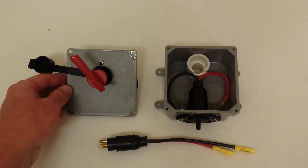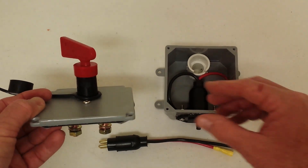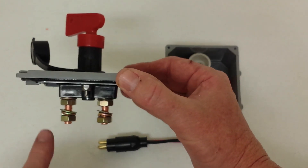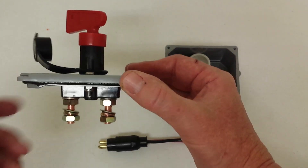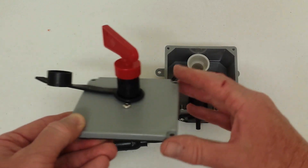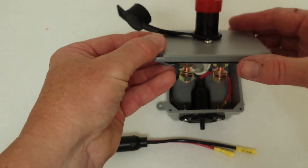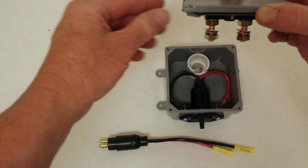This here is the kill switch, which was actually recommended to me by a friend on Facebook. It will easily work with this 12 volt system because it's rated up to 200 amps. You have your two connection posts here — one is your direct input from your battery power and the other goes to the power in the box for the plug. When I was measuring to put this kill switch in, I had to be careful because these two posts had to clear the socket for the power plug. I measured it so these two posts would ride on either side of the most narrow part of that socket.